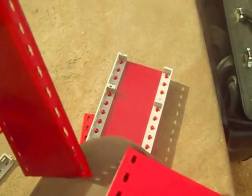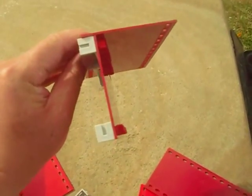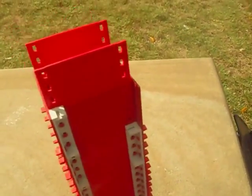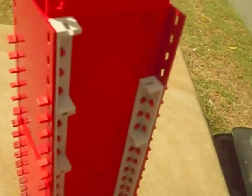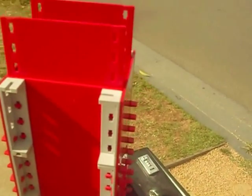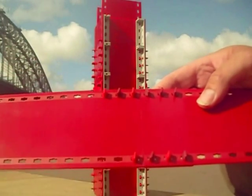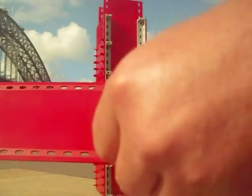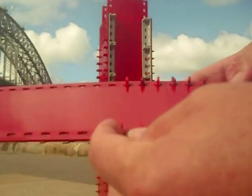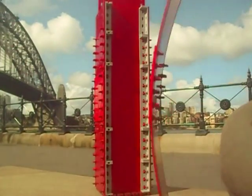The plates are flat and are quite easy to bend. Angle iron is riveted onto the edges of the plate - that's half of it, that's all of it, and that bit just goes there like that. The rivets go in red hot and the end gets bashed over by somebody on the other side with a riveting tool. When they cool down they pull the plates together so hard that the plates physically grip each other - the rivets clamp the plates together and the stress doesn't go through the rivets, it goes directly from one plate to the other. But as you can see, that's not very strong on its own.